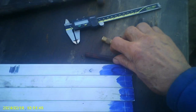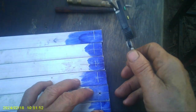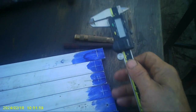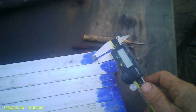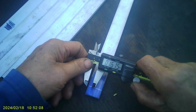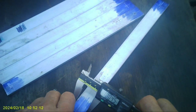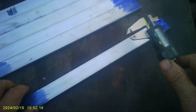These are the six wing spars or arms. This end here is going to have a 5/8-inch bearing with a 1/4-inch shaft. The way I marked these out was I went in .057 from this end. These are 1 inch wide, 1/4 inch thick, and 12 inches long.